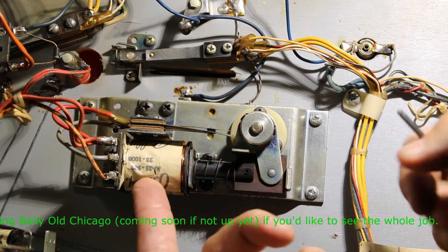As it turns it's flipping your flipper. It comes to the end — this isn't adjusted right, I'll have to adjust it before we're done — but as it pulls in, right about at the end, it opens up. This is your end of stroke switch. What that does is it opens up, and there's actually two coils in here: one's got low resistance for your power to shoot the ball up the playfield, and the other half is a high resistance.